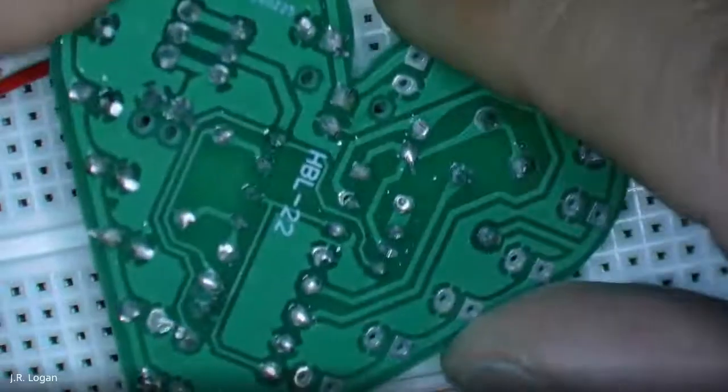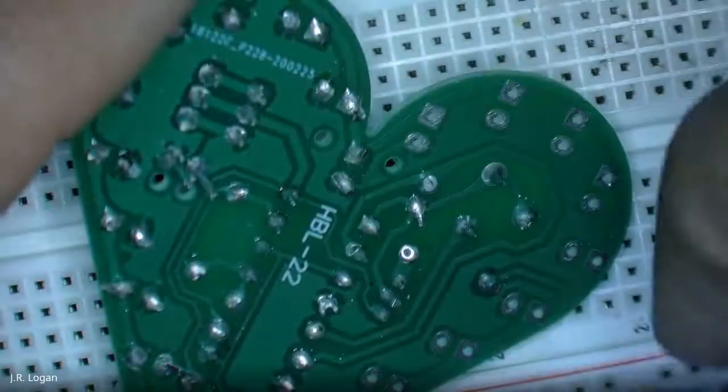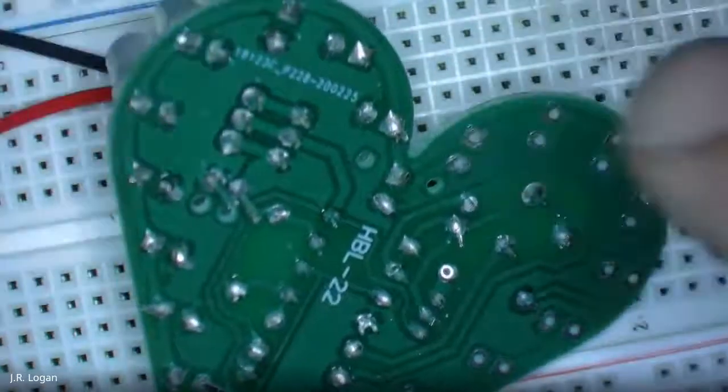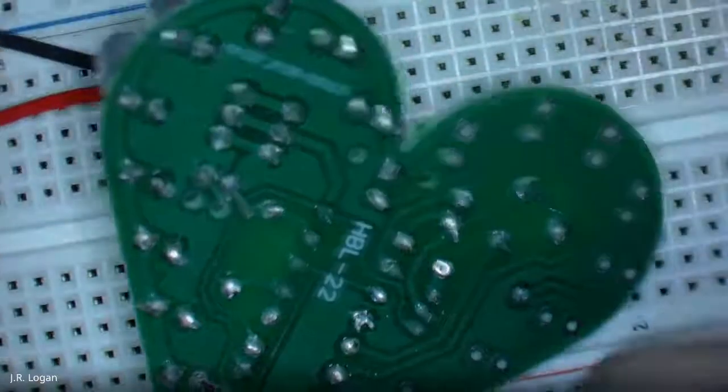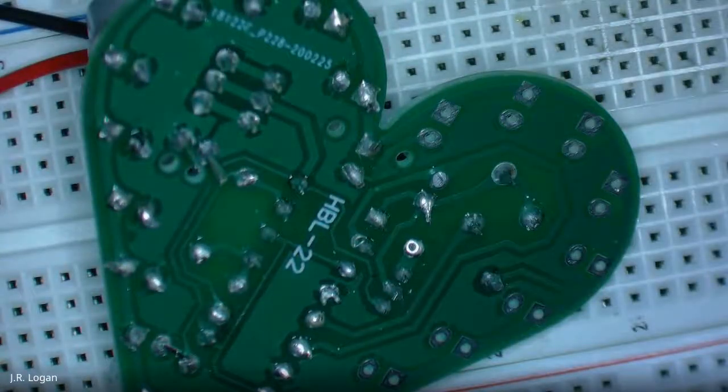And then a lot of times the software will do an auto routing, and it will figure out the best way for that to be routed through there. If you have something very complex where things are intertwined, you may have to do multiple layers. They can print these PCBs, and then they sandwich them together. So you don't see that there are multiple layers, but those layers are there, and they have different patterns connecting different elements on your board. And there's something called a via, like transport, that will connect between different layers. You'll see them as little metal tunnels inside the board.